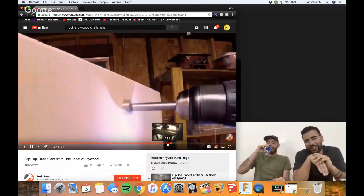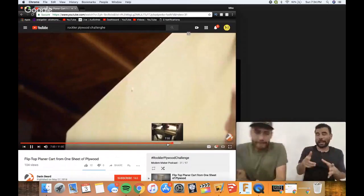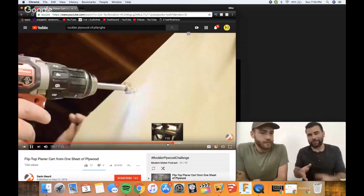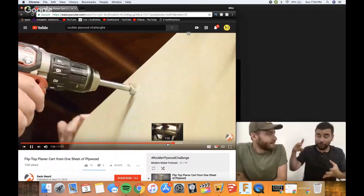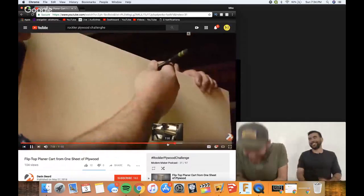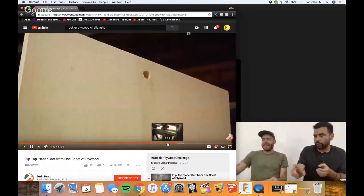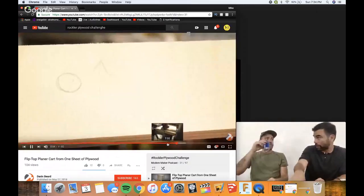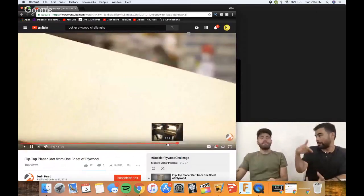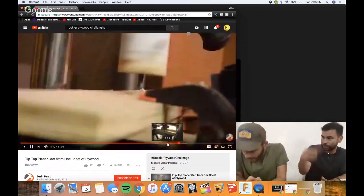With the Great Store, we were doing so much stacked plywood, and we were in such time constraints. There were so many times where every time you hit screw on screw, it doesn't just screw up that screw. Often if you already put in three perfectly good screws, it jacks up. We're using an impact driver, and the impact driver is so powerful, it rips some of the plywood apart.